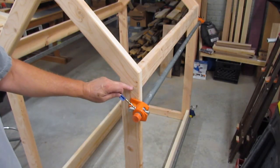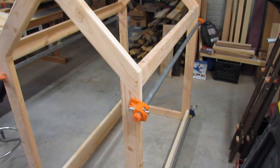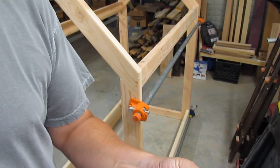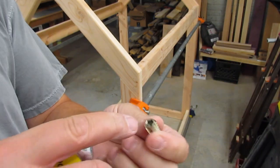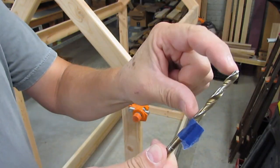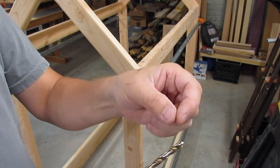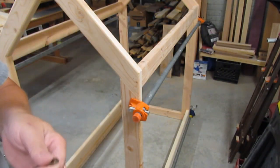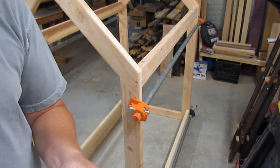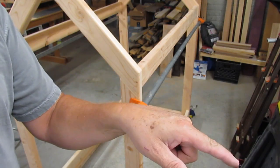Now I've got all my holes located for the six ends of the 2x4s. I'm using two-inch quarter-by-20 knockdown bolts. On the receiving piece you put in a metal insert — threaded quarter-by-20 on the inside and very coarse-threaded on the outside. I epoxy them in. Because these are quarter-by-20, I drill a quarter-inch through-hole on the bolt side, with a piece of masking tape marked at two and an eighth from the tip as a depth stop. On the receiving piece I drill an 11/32-inch hole because that's what the insert takes. I'll leave a link in the description for where to get these bolts and inserts.